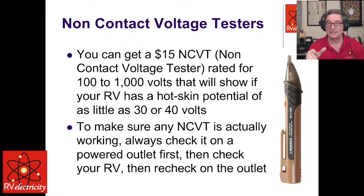The gold standard then is to actually put a real AC meter on that you know how to use. And I will also tell you, please, when you get these, use them to test a battery and test a fuse and test stuff with this so that you're comfortable. That's not the very first time that you've had to use it, when you're cold and wet and absolutely trying to figure something out. Go do this so that you're used to it. Measure an outlet in your home where it's safe and dry. Measure the voltage in your car, on a car battery. Just measure things, and that way you know how your meters work.